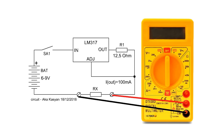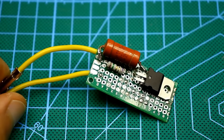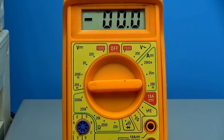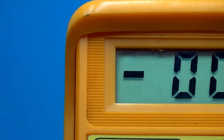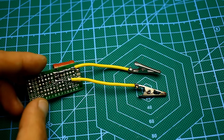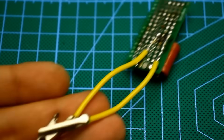This adapter also requires an external power source with a voltage of 6 to 9 volts. To obtain accurate results, I recommend using high-precision multimeters. Cheap DT830s have a large error when measuring low voltages, but if highly accurate readings aren't crucial, the good old 830 will do. The measuring wires to which the resistor is connected should preferably have a diameter of 1 mm or more and be as short as possible, as there is a voltage drop on them which will affect the final result.